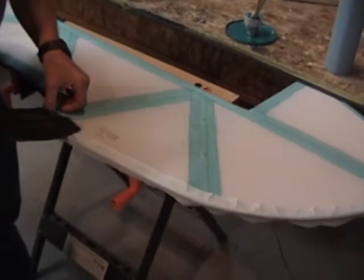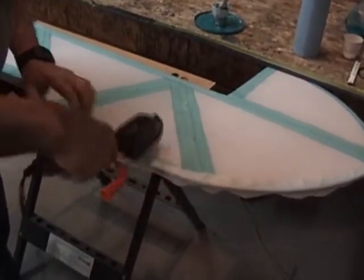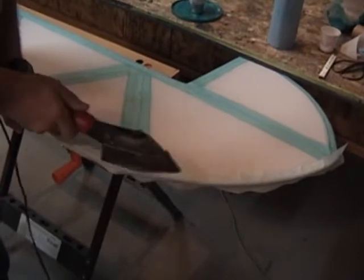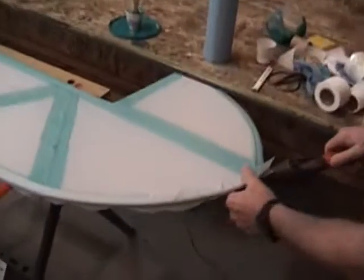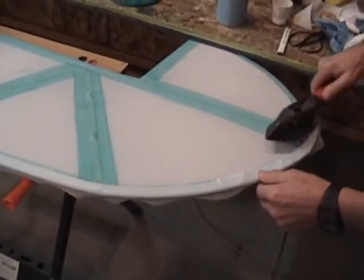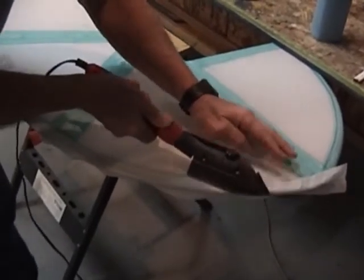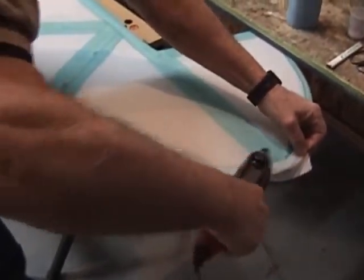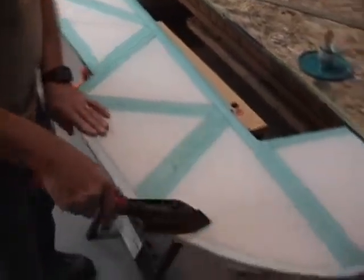What we want to do now is take an iron and run it in here, and you'll find that starts to shrink the tape. See a little shrink coming on it there. It'll come part way around that radius. Start at the other end, keep pulling it in, step back over here in the middle, and just bring it right on around. You can see how easy it is to take a non-biased tape and get a very nice finish around the edge of this surface.